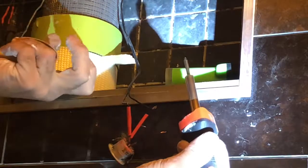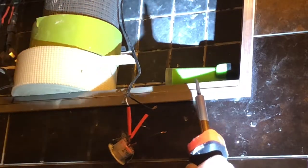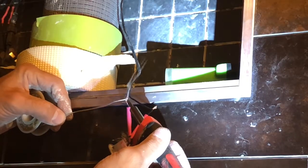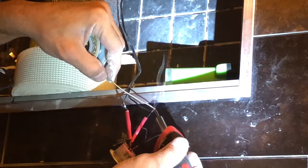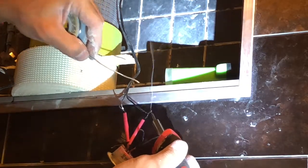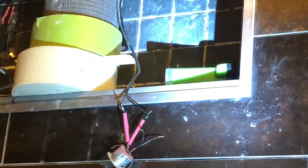Next, you got your soldering iron on. I got my solder right here, and I'm using lead-free solder. You can use leaded solder, but that's not good for using it in a shower, because it doesn't do very well when it gets wet. It can start to corrode your wires. So that's how simple that was. I got it soldered on there.